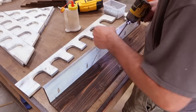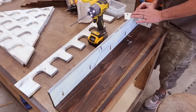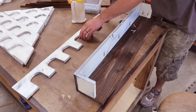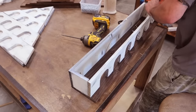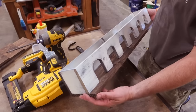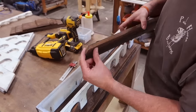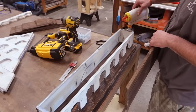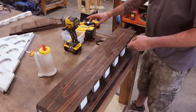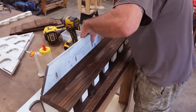Let's start putting this together. Start with taking your first divider H — the one with square ends — and attach parts A to the back. For the two sidewalls G, I'll also be putting some nails and glue since I do not have pocket holes joining it from the side. Now we're ready to attach our front part A, also using glue and nails. We'll finish up by putting pocket holes in the front and our first level is done. Now we're ready for the second divider I — this divider will have the bevels on it, and the remaining dividers all have bevels. I'll put glue down first and then throw in some nails to hold it in place. When putting nails in the front, I use a little tool to gauge the depth so I don't shoot a nail through — a piece of scrap works just as well.